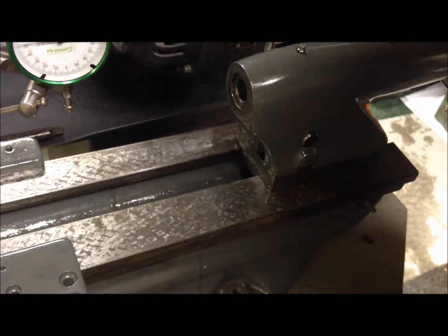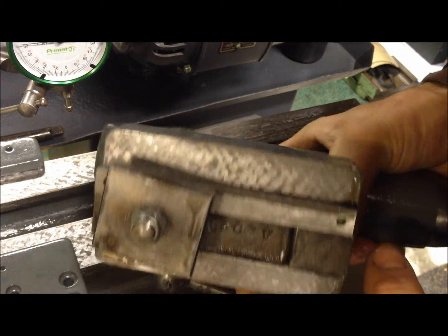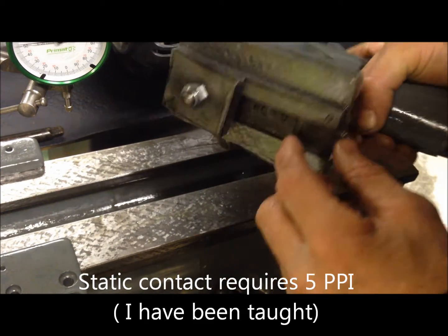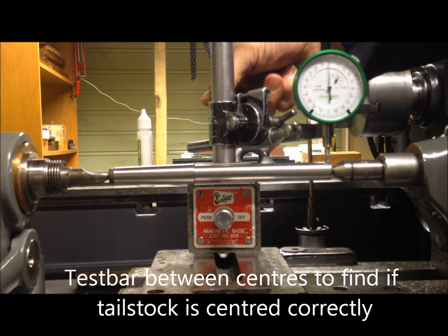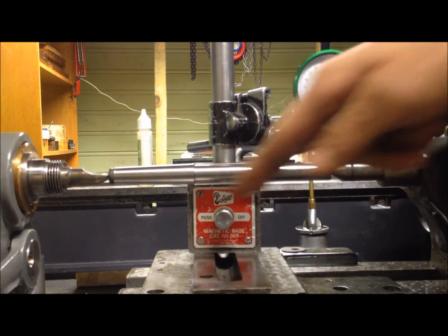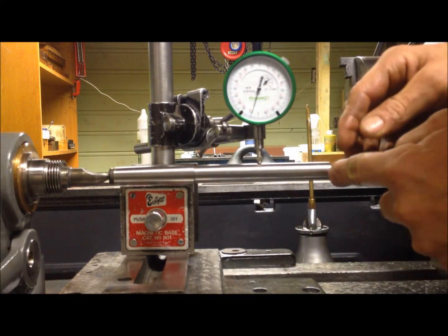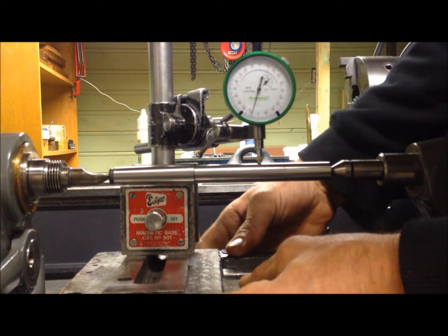As I said, I would have had to do this anyway — at least I wanted to — and I also need to prove that this is scraped correctly so that it has enough static contact towards the bed there. The shim adjustment and scraping also needed to be done. I zeroed the indicator there, and when the needle goes that way it means that when I go that way it drops. Lo and behold, it does. Which confirms the center-to-center reading: the tailstock is high. Which is very nice, because then instead of shimming, I can scrape it.